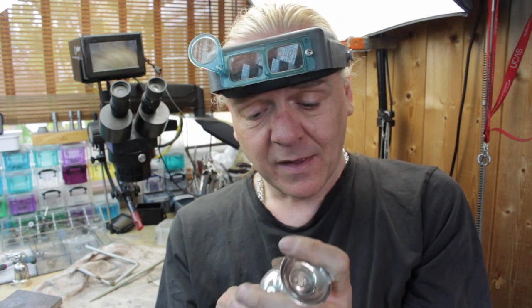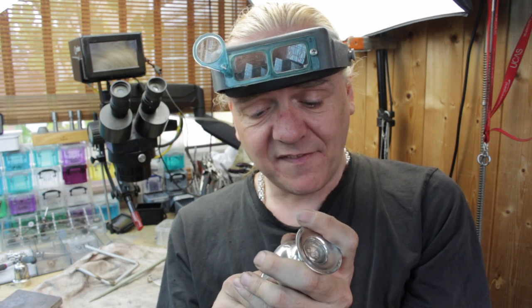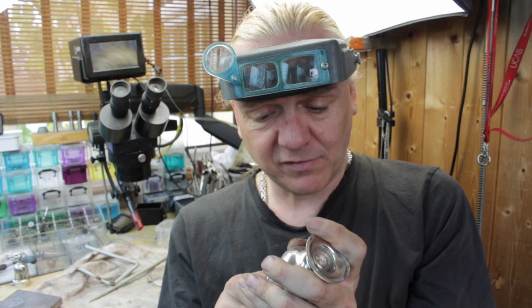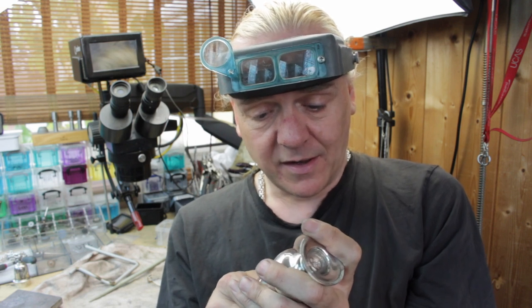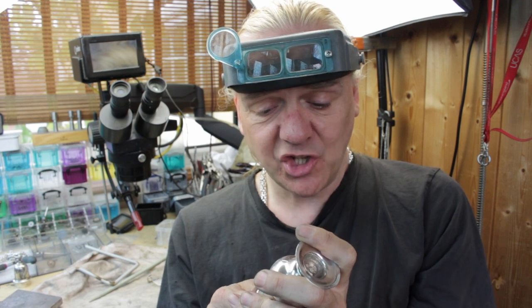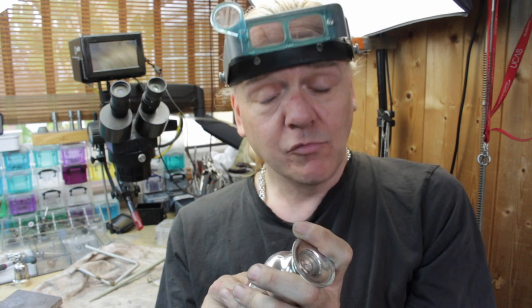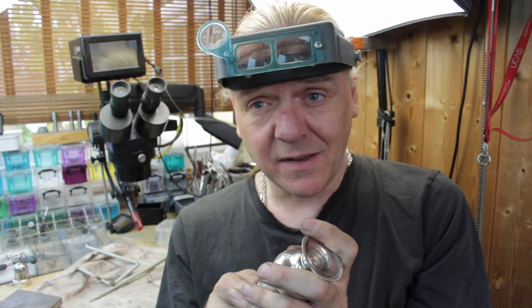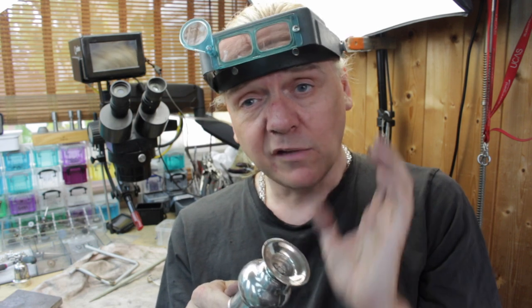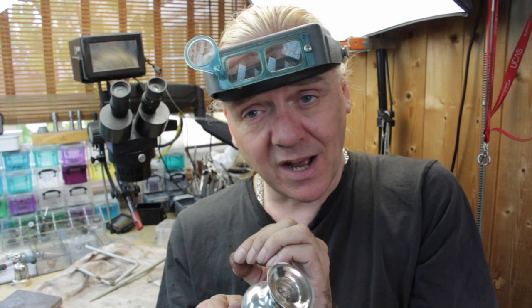So I put the bolt inside, gently feeling for the bump — I can feel it rocking there. Then I start to press with my fingers. It's just taking your time and being very, very gentle. Remember what I said at the beginning: I can't over-polish this because the metal is thin. So I have to get this as perfect as I can and then just a very light polish. It's worth spending the time now to get it right rather than trying to correct a mistake afterwards.